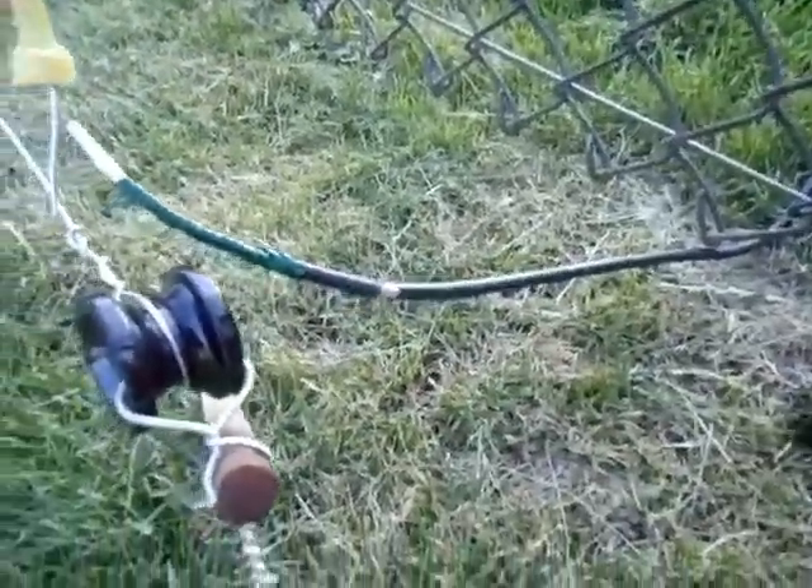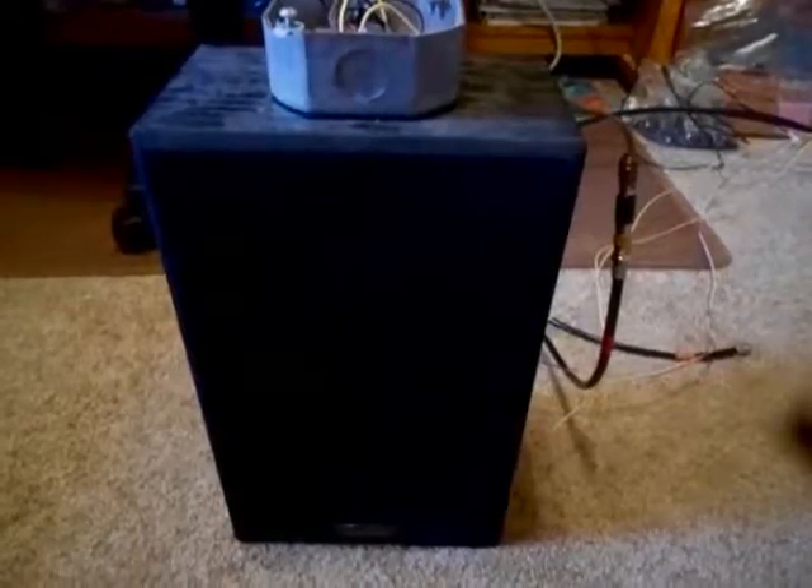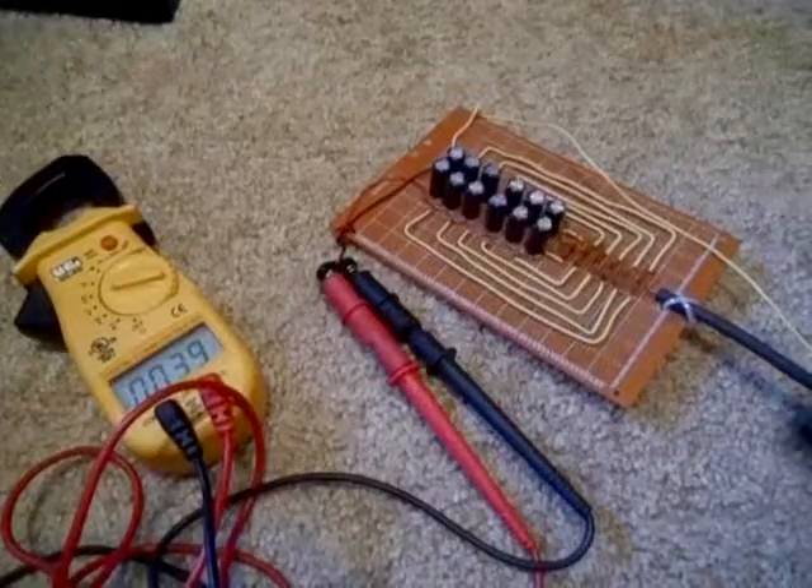I just have it go into some coax cable. Let's go inside and see what we can pick up. I hooked it directly to an LM386 audio amplifier and speaker — you can hear the AM buzzing and a little bit of static electricity. Let's hook a ground wire to it and see what it sounds like. Sounds like a morning church on 620 AM.